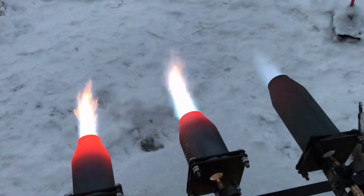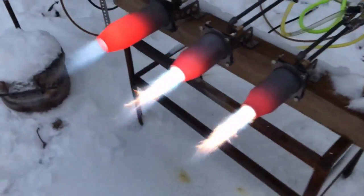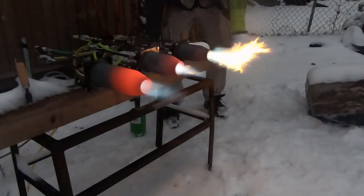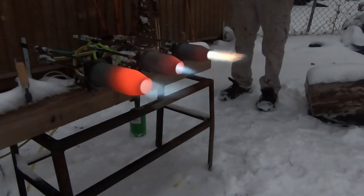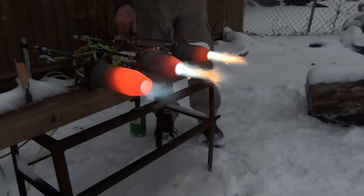It's too cold out for me to push enough air to run all three of these right now. What happens is ice forms in my airlines — this is about the best I could do. If I push more air than this it starts freezing up on me. I tried to do a demonstration of both of these running full tilt, but we will not be able to do that today due to the weather. I just wanted to show you what it looks like with all three of them going. Now this setting right here is the actual ideal setting — you don't want a big monster flame burning up the bottom of the boiler again. So we're going to have to train these guys to light these things and set them in high velocity flame mode, not high fire mode. There's a difference.